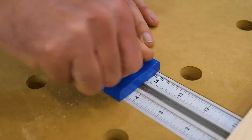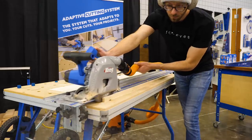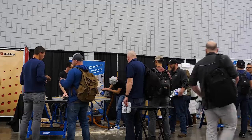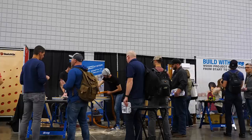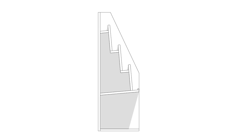Next I'm going to set my fence at 14 and a quarter inches and cut out my box bottom piece. Then I'm tilting the saw blade to 5 degrees to cut the bevels on both sides of my bottom shelf and the back edge of my top shelf bottom. One should be a parallelogram and one should be a quadrilateral where two edges are 90 degrees and one corner is at 95 and one at 85 degrees — so the pieces sit flush with the back panel and give the shelves that desired lean so books don't tip forward.